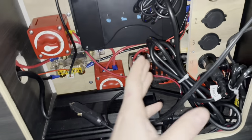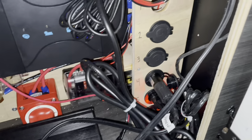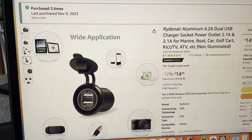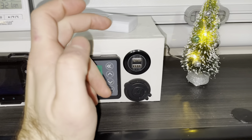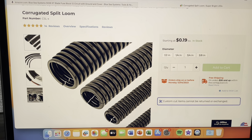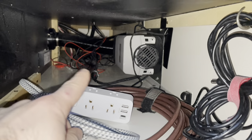All the wiring we got either came with the product we bought or came from our local Home Depot. These wires and blue connectors came from Home Depot, and for the 12 volt plugs — the ones down here and the ones up there — I just went with no-name brand ones on Amazon that had good reviews. I specifically picked these USB ports because they were dual port and they did not light up — I didn't want them lighting up really bright at night. Looking at the outside side storage compartment, we had to drill a hole to run our wires up into the bottom of the counter. They're wrapped nicely in wire loom, running out of the back of that cubby, up the inside, and into a hole drilled into the bottom of the white box. The diesel heater is also mounted in here with its wires running up through.